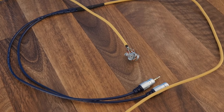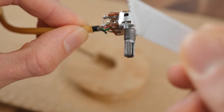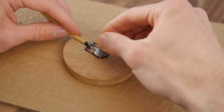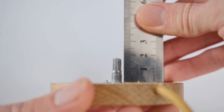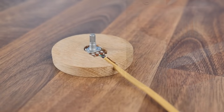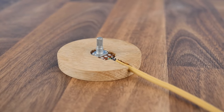Once that's done, the potentiometer can be glued inside the base using some epoxy. When you do this, make sure that there's no chance of the glue entering the small gaps in the sides of the potentiometer, which would damage it, and also that the shaft is perfectly vertical whilst it sets. Once it has set, it's time to add the concrete, which is where this build gets particularly fun.